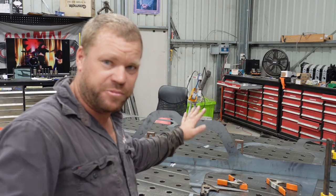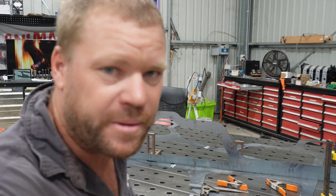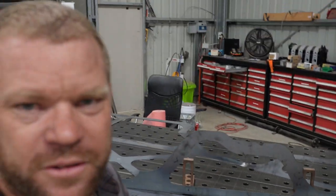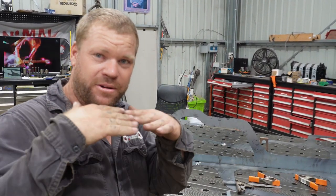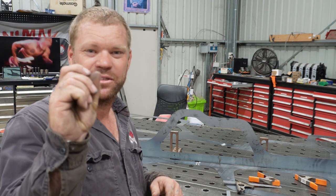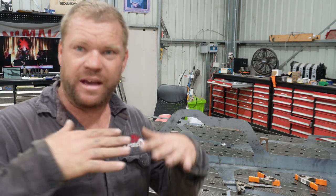Righty-o, well I have the first pieces on the table. You can kind of see the inner diff cradle centre section there. So, you might be able to see a bit easier now. Sort of all my little locating bits for each piece to make sure they go and interlink. When I done it up on the computer, I think I allowed, I think it was 0.2 of a mil. So basically I just took a 0.2 sliver out of the drawing and then basically they fit together. They fit together really, really well. So that should help locate everything and keep it square.